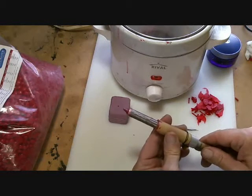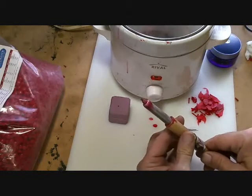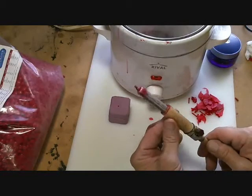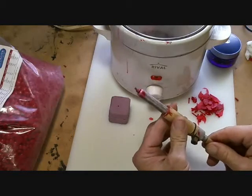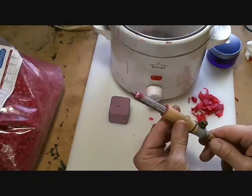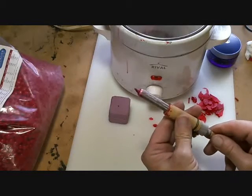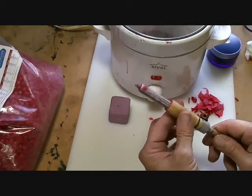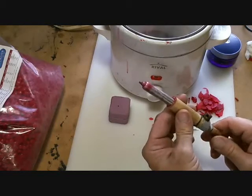I'm going to show you how to make some wax patterns using some pretty simple tools. This device here is an old air cylinder that I got from my friend Bart. He also gets the credit for coming up with the idea to use this. It's made of aluminum, and I've insulated it with some wood here to keep from burning my fingers.